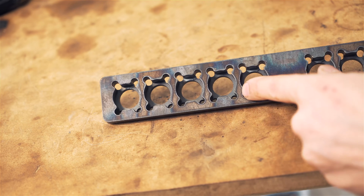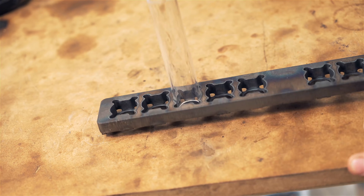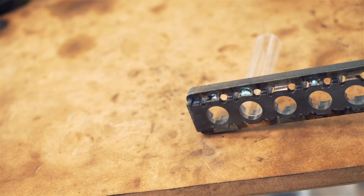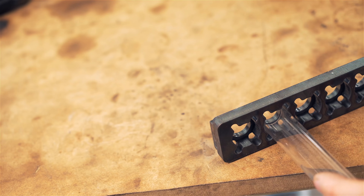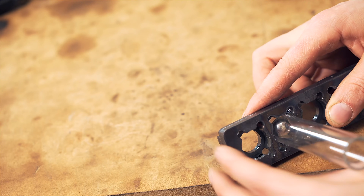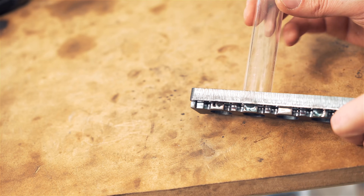I thought I should explain why this inner hole is offset half a millimeter. A PMMA pipe will fit like so — it actually clicks in really neatly. When the marbles are coming, I do not want a ledge here. By offsetting this hole lower, there's no ledge for the marble that way. But if I turn the pipe the other way, we have a tiny tiny ledge — you can see the marble sticks on that ledge. So that's the whole reason for offsetting the hole: no obstacle in the marble path, no risk of marbles getting stuck.